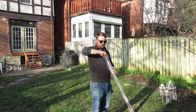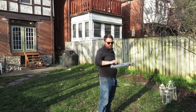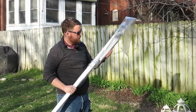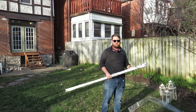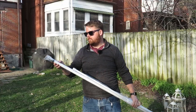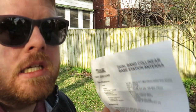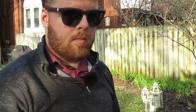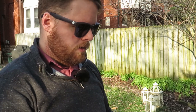This antenna is really cheap compared to what Diamond makes, like the X50. Supposedly it does just as well if not better than all the other ones, but it does have issues — the biggest one is water gets into it because it's not weatherproof. A lot of people say just put some self-amalgamating tape on the joints so they don't get water in them. It's rated 200 watts on 70 centimeters and uses a UHF female SO-239 connector. I despise outdoor antennas that use SO-239 because they're not waterproof — an N connector would be much more preferable. Better antennas like Diamond and Comet use N connectors, some do, some don't. Total height is 16 feet — it's going to be about half as tall as my house.